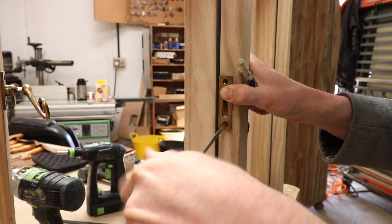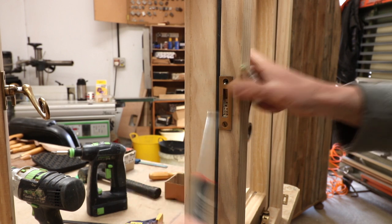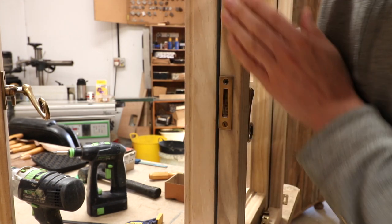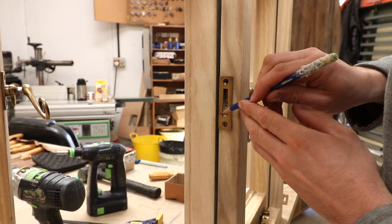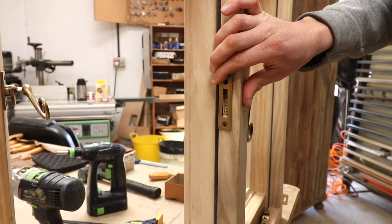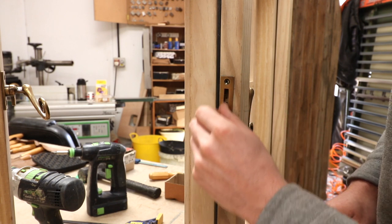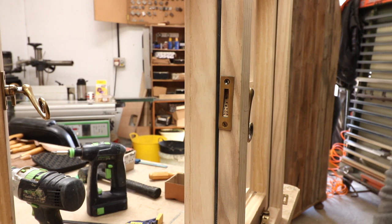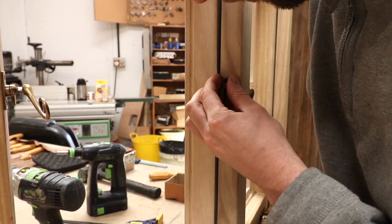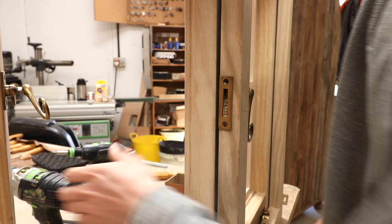So I'm using that line there — those two lines marry up and that works with the bottom of that plate. Pilot drill this hole here and pop a screw in, just enough pressure on that screw to hold it for a start. That's the bottom one done. I just align that plate so it's nice and parallel with the timber on the window. If the hole in that plate is square as a profile with no taper, you do have the option of tilting the plate to create a slight wedge shape for the fastener to engage against to pull the window seal in — but these are quality fasteners with that wedge shape built in. So align it parallel with the window — they do look best if they're parallel — then drill and screw that one as well.